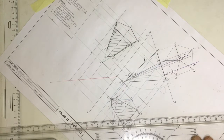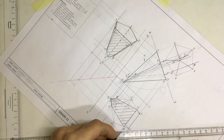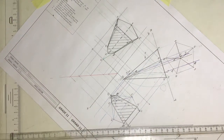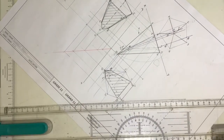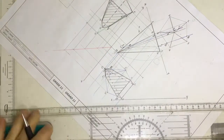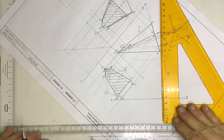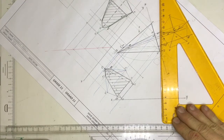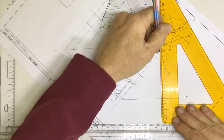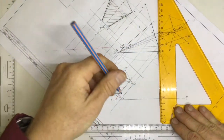I can now draw an xy-axis somewhere over here. There's my new xy-axis — X, Y. I can now take lines coming down from all of these points. I'm going to take it from number four and three over there, coming down. Note it's at 90 degrees to the xy-axis, which means that I'm looking at this thing at 90 degrees.